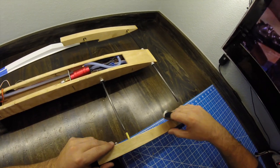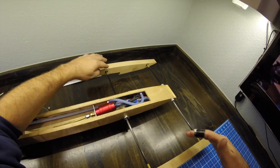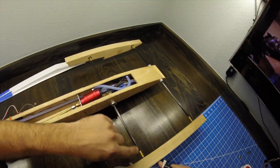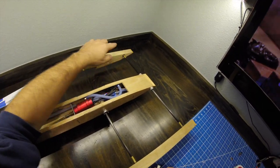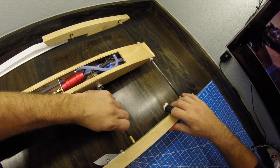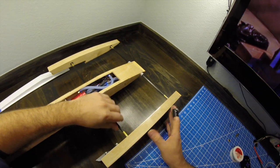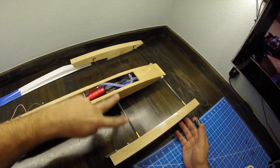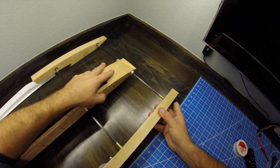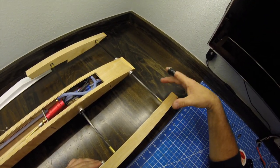When you drill the boom tubes, when you get it on here, make sure you've got even distance. You want this distance to this tub even, the same as these numbers that you get on this side. So you want this side parallel, but on the turn fin side, to kind of counteract the turn fin, I always do toe-in. So what that means is this will be the same length here, here, here, but then this is short by maybe 2 to 3 millimeters, or a 16th to an 1/8 inch.